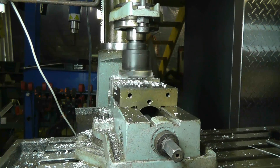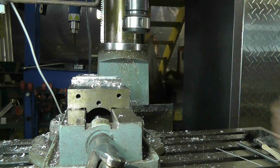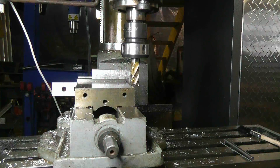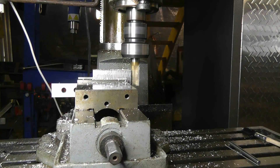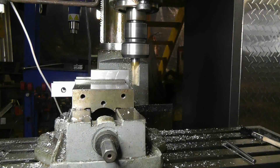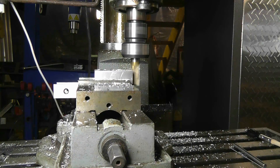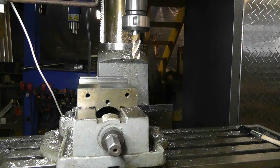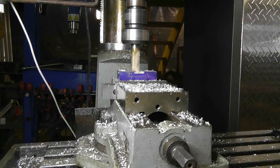In any case I had a fair bit of stock to remove. I've checked the length so I'm going to swap that out and put an end mill in — that's a three-quarter inch end mill — and just finish up the ends on the piece of stock. For one side I didn't take a lot off, and the other side I took most of it off to get it to correct length. As I said before, none of these dimensions are particularly critical. Once I'm done this I'll take it out of the vise, mark it up, and then we'll rough out the center portion so that the dovetail cutter doesn't have much material to remove.